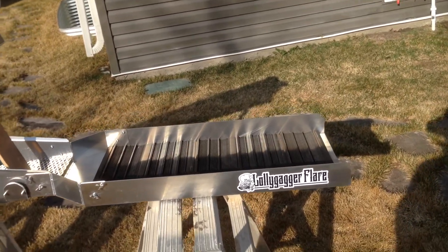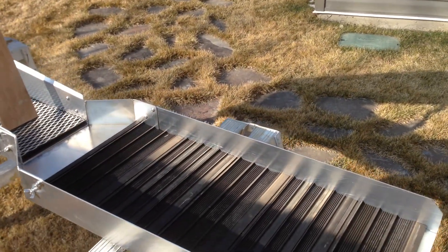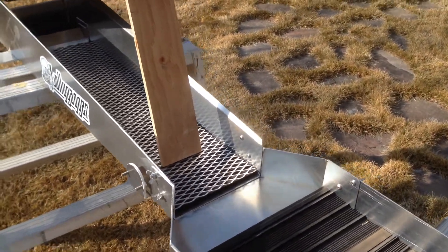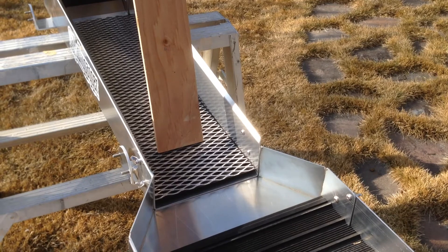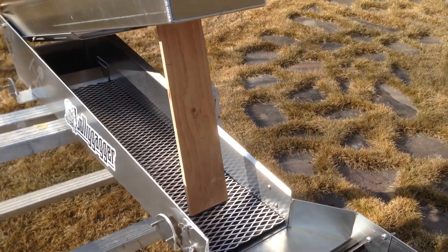In this flare I went with a hog mat and I did the razorback scrubber configuration. In the main sluice I did the UR with a quarter-inch raised expanded. I just have flat expanded now as a visual demonstration — it will be replaced.